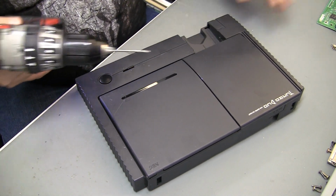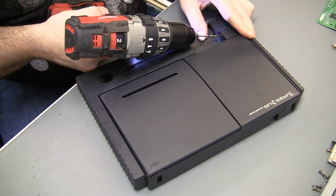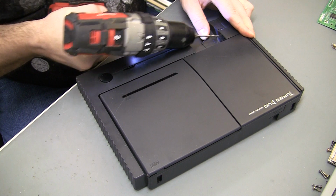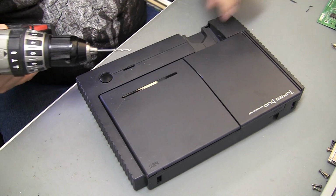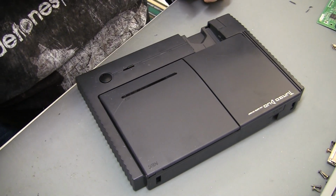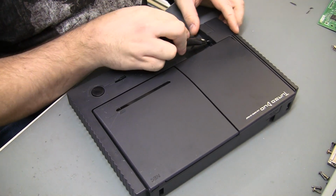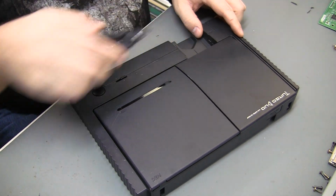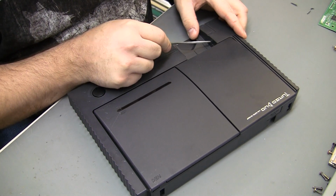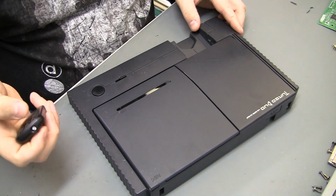Now I normally drill 2 holes and then come back in with the file. Gotta watch that edge right there so the drill doesn't mar it up, and I believe I was successful. Get the X-Acto blade back in there and snip out some of that plastic. Then take my little square file, get in there, and attempt to make it look as square as possible.